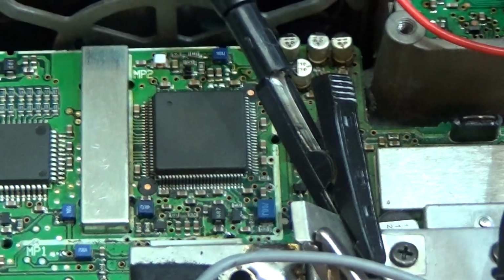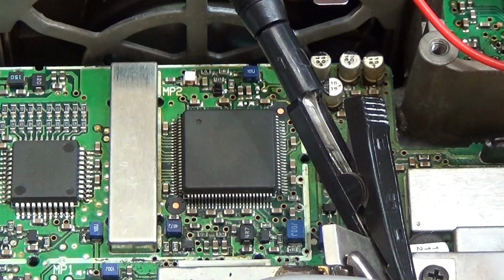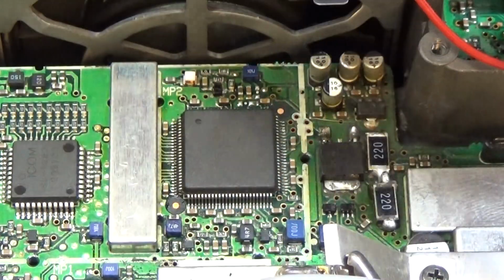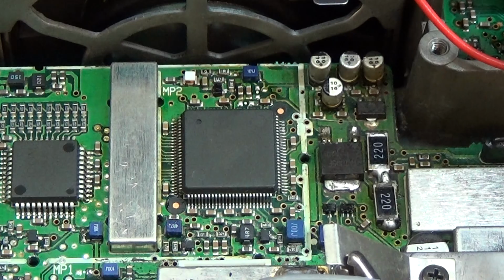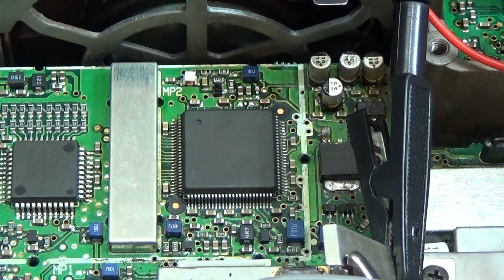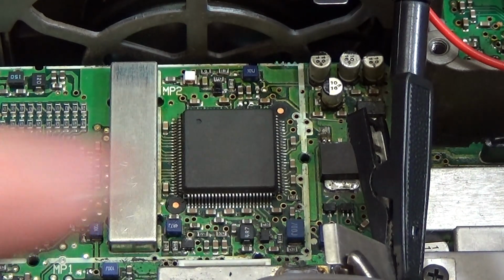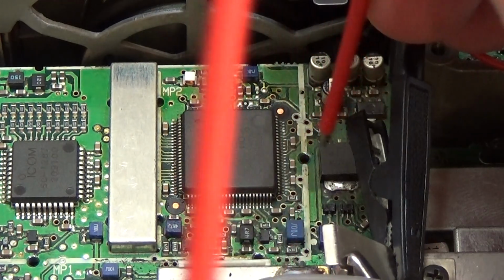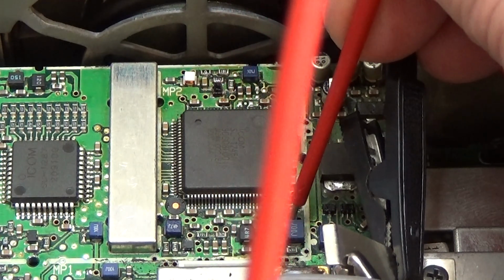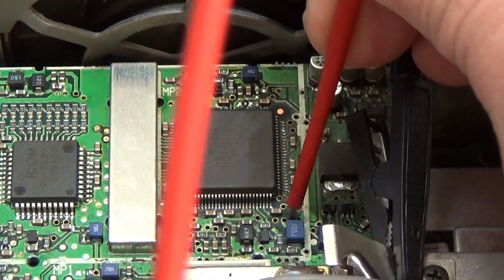But I'm interested in what's happening if I do exactly the same with the other IC. I need to put down my ground from my test power supply, and I just want to do the same. So again, it's a 5-volt IC, and now when I put it down here, I should see something, and yeah, that is looking much better. So let me show you what I see.